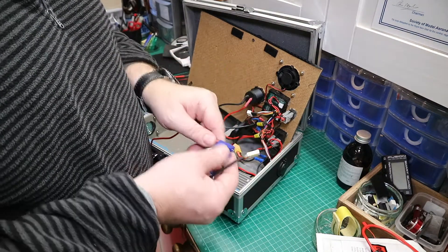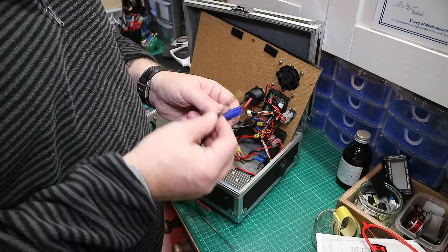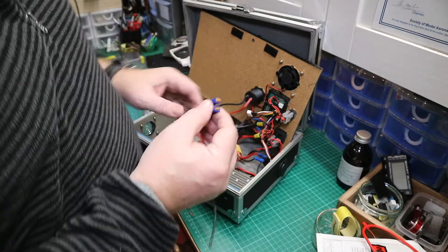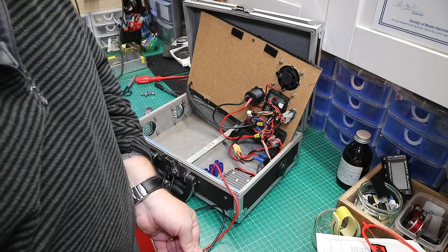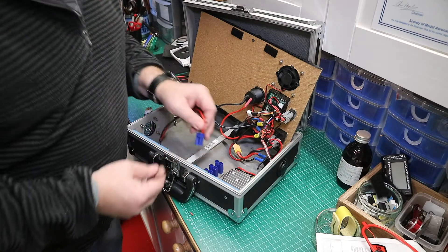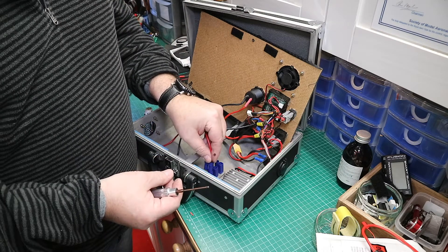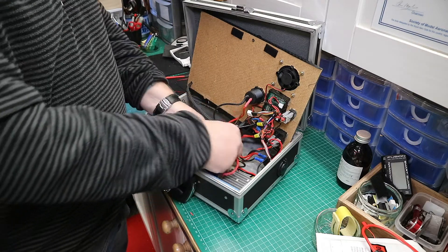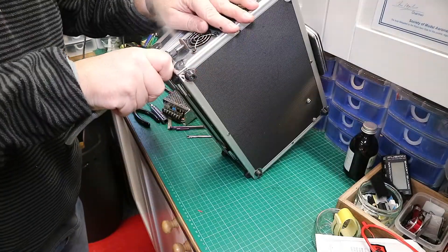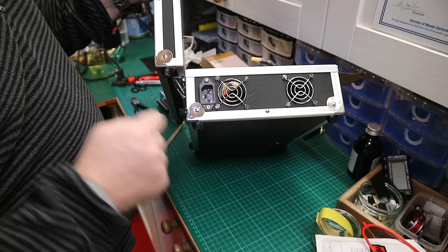For those of you who haven't seen EC3s or these EC5s - basically you solder the end on so you're not messing around with the plug or causing any heat damage to the plug, and then you simply thread it through there. You notice it's loose, and then you simply click them in - so that's now popped in. You can see there's positive and negative printed on there, but it's the flat edge that's the positive. So that is going to plug in there, and that will be my 12 volt supply from my power supply. All I've got left now is the mains connection.